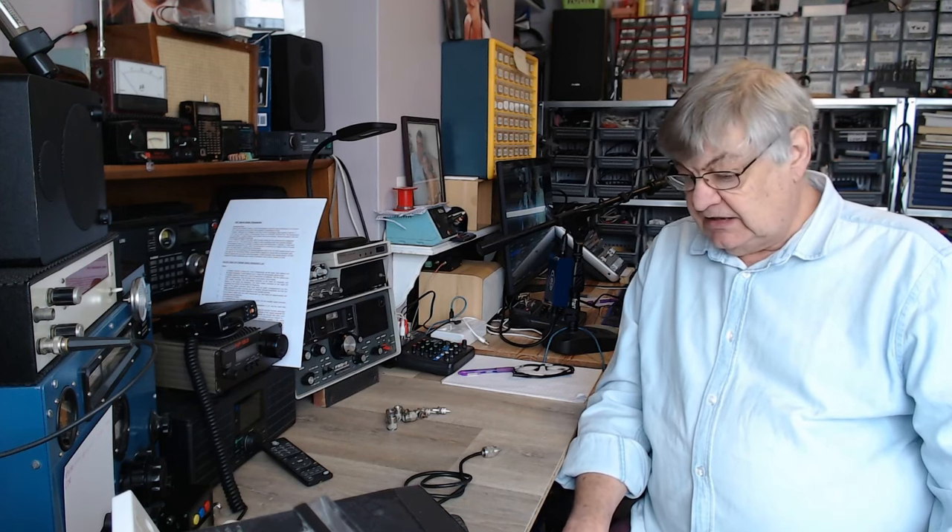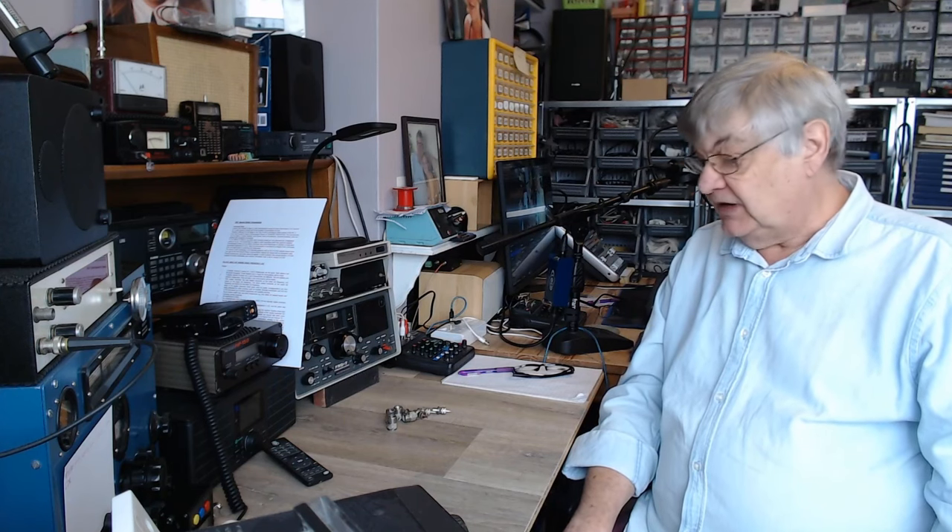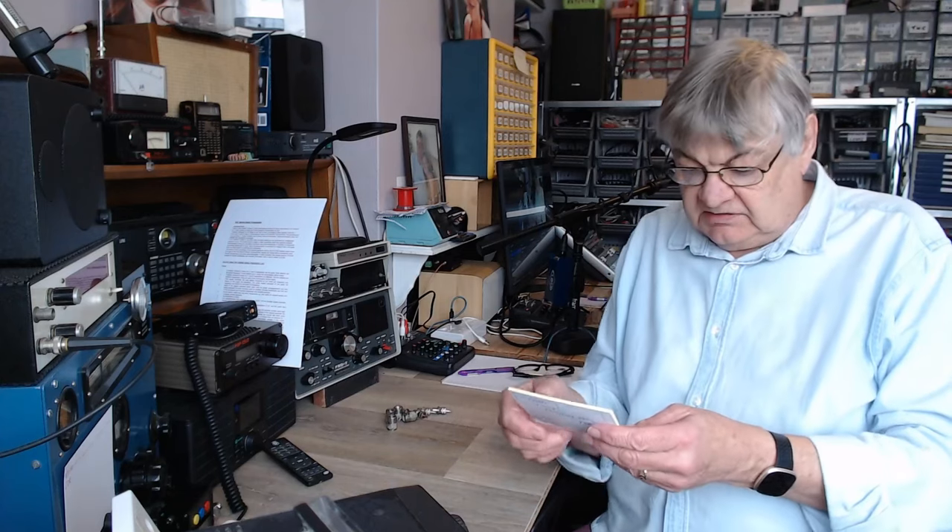Make up your own mind — I might be wrong. Have a look at all the charts; type in 'coax loss chart' and see for yourself. I've also used the 214 on the 10-meter band at 28–29 MHz. I haven't noticed any change in noise there, but signals have really come up. I know some locals and their signal strength, and having replaced the RG-8X with the 214, the signals have improved noticeably. All these years I thought the double screening was about loss — it is to an extent, but mainly it's EMI.